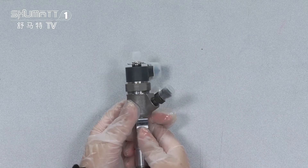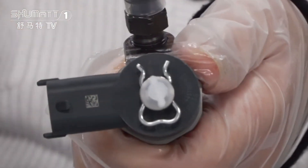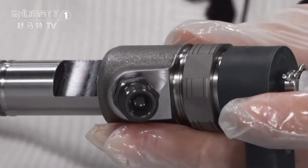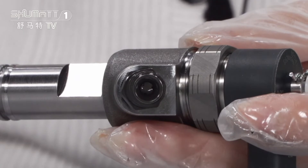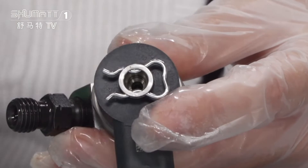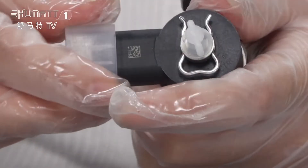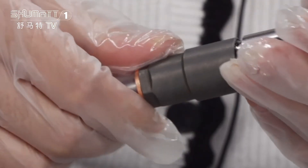Now let's check the details. You can see the solid construction of all the spare parts — we already use protection covers on each one. When I turn it around, you'll find there is a plug. At this position, inside, there is a triangle valve. Generally, the oil goes in through this position and comes out from this side. This here is the injector body, and at the end is the injector nozzle.